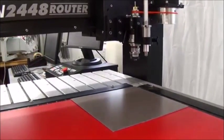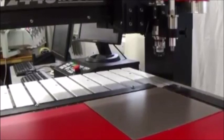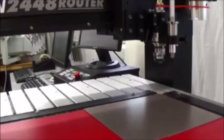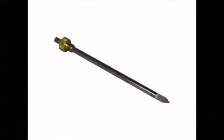Press the go to home button to send the spindle back to the home position. Several ADA compliant templates are included with the software. They can be modified to create custom ADA compliant signs. After you create tool paths to cut the raised elements and drill the holes for the raster spheres, your job is ready to send to the machine.